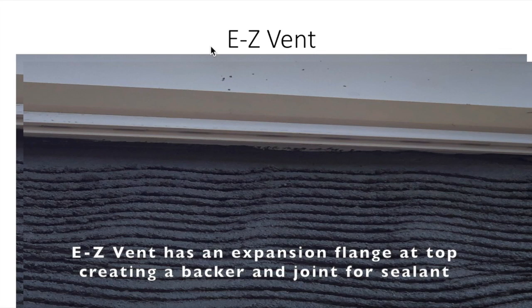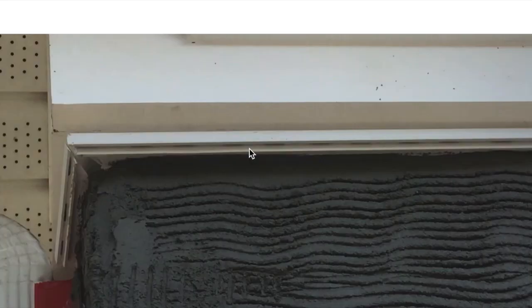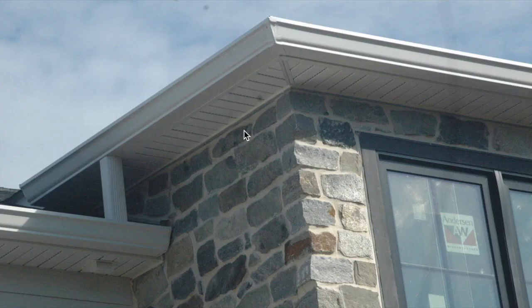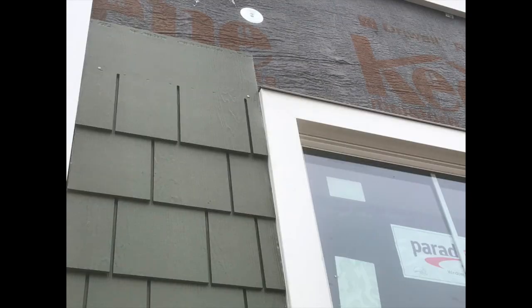So let's check out the Easy Vent. Here at the top of the wall, you can see the vents there — that's where our air is going to come out. As you can see, it's installed over top of the Keen Rain Screen. The Keen Rain Screen creates a gap in which air ventilates up through convection and out the channel, and it sits on top of that Keen Rain Screen. Lath and mortar is then applied up to the ground of the Easy Vent, and the vents are in place, ready to go. On this project, you can see it's got a Drain Screen and an Easy Vent at the top for full wall ventilation.